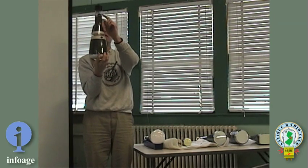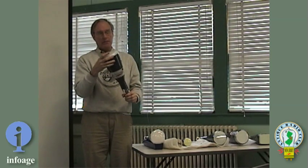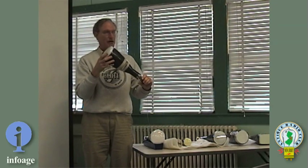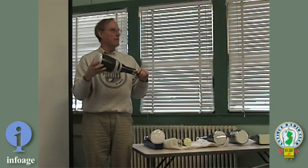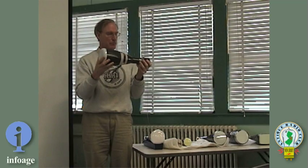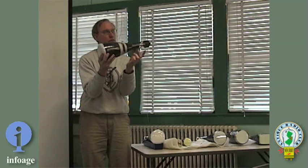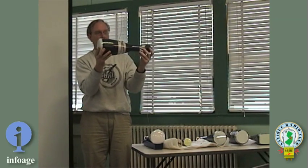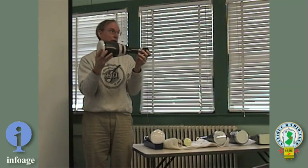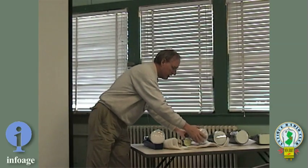You can see the same structure here — you can see the electron beam. The style of oscilloscope you could build with this tube was a low frequency affair, because it took a couple of hundred volts to deflect the beam from side to side. The entire acceleration velocity of the beam was present from one end of the tube to the other, so the electrons passed through the deflection plates very quickly and it took a lot of voltage to move them. That's one of the key points in the design of a CRT.